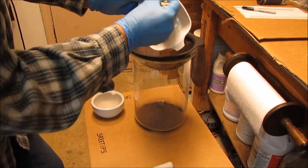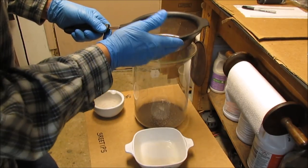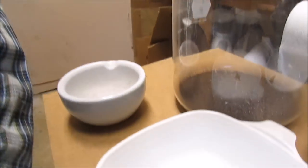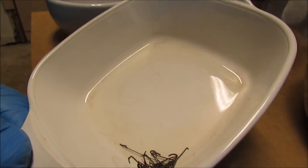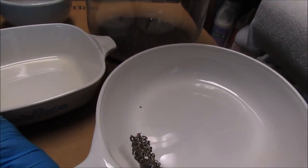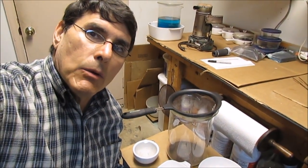I put the magnetic material back into the wire screen to sift off any fine pieces of precious metals, then put the magnetic scrap back into the square Corningware dish for disposal. I've completed the initial screening of the jeweler's drawer sweeps. I pressed everything up in a mortar and pestle and poured it through a coarse sieve, ending up with some metal objects that are not precious metals — iron, staples, and saw blades. I'll now go ahead and do the fine sifting with a fine sieve.